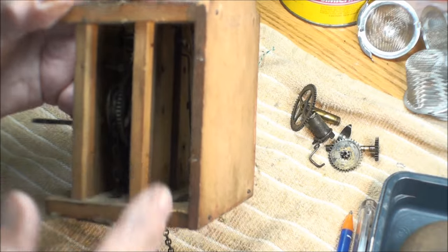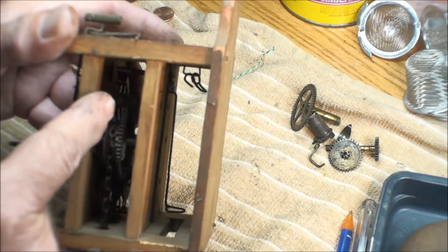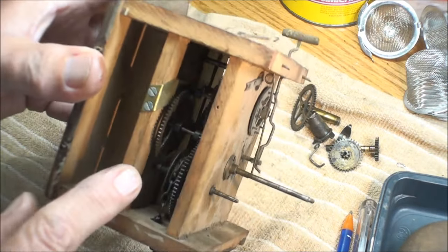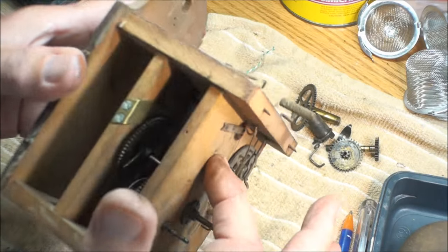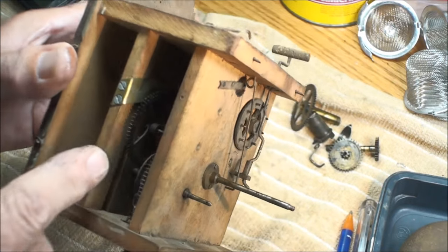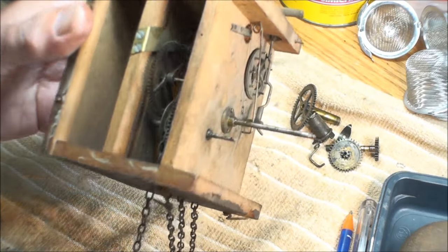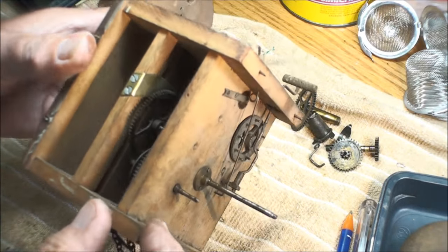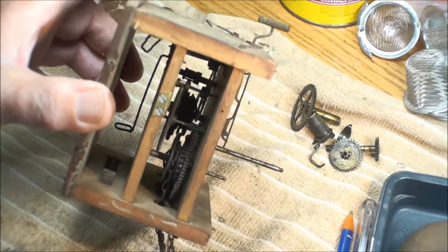through here, counting. So the first stick is just a stick, second stick has to do with the winding and the gear that comes around to the front here. This first plate does nothing but hold this bracket. And this is brass, and it goes to the part where the pendulum will be hitting. And this chain came with this. It looks like 8-day chain. Older clocks, I think, were bigger chains back then. But I'm just trying to figure out how I can get this out, because like I say, I do want to clean those gears. So let me think about this a minute.